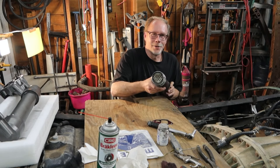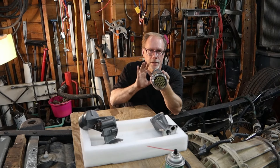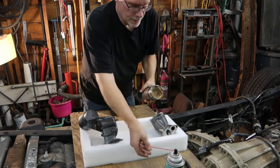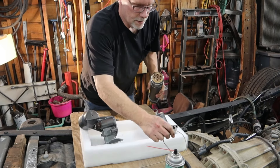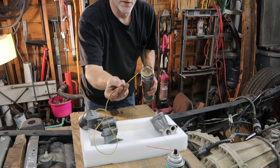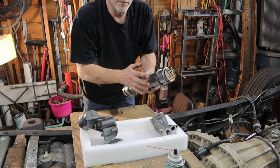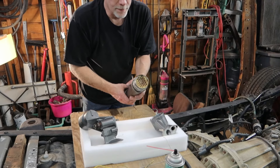This is probably the most crucial part of cleaning — the inside here. You've got to make sure you put this up into the light and confirm that every tube going through here is completely clean with no crud in it. You can find yourself a nice wire and let it go all the way through, or take some stiffer 12-volt wire and run it all the way through. Either which way, make sure that's clean. No use throwing new o-rings on if the inside is still dirty.